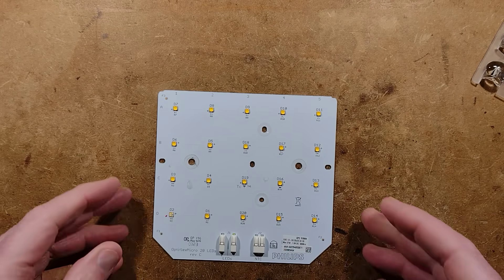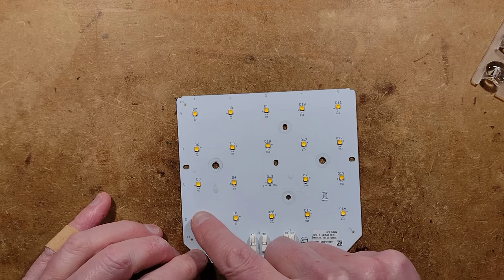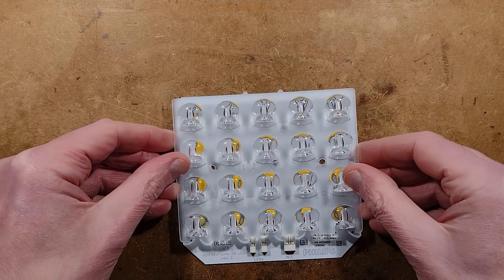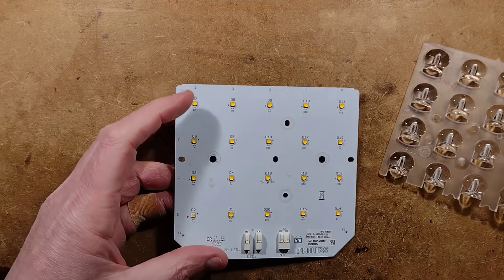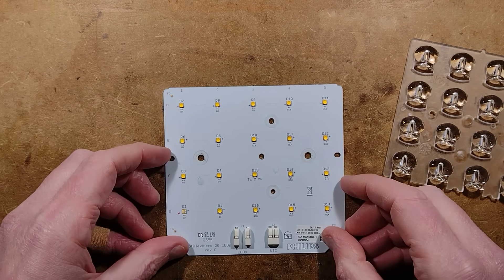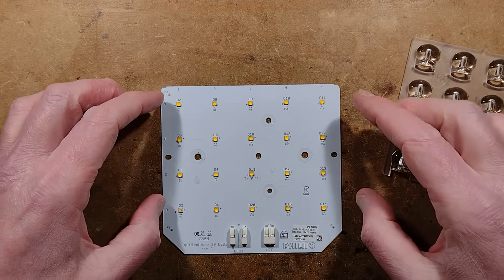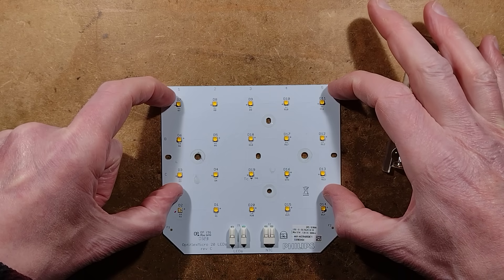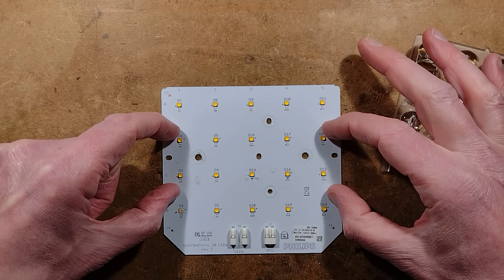However, that one didn't light up, and as I was probing about trying to get a good connection, I suddenly realised the lens was missing — I don't know if that was me taking this off or if it was a lens that detached and dropped out. It doesn't really matter because it turns out they can be bridged. For instance, if they want to make a street light rated three quarters of that power, they might choose just to populate certain LEDs.